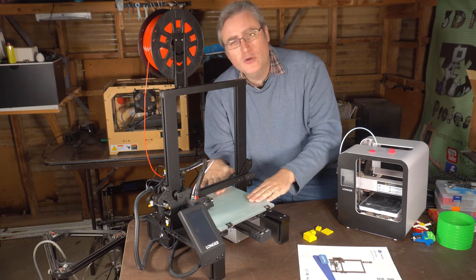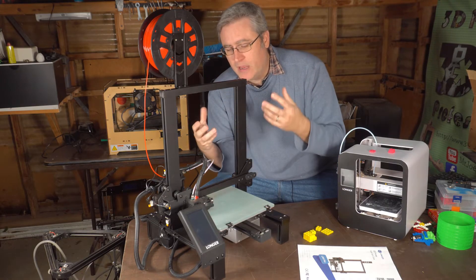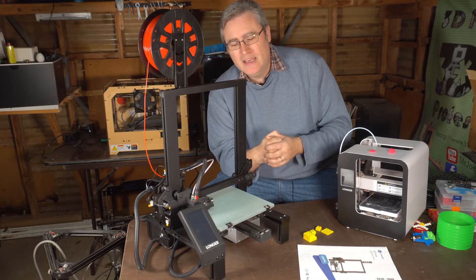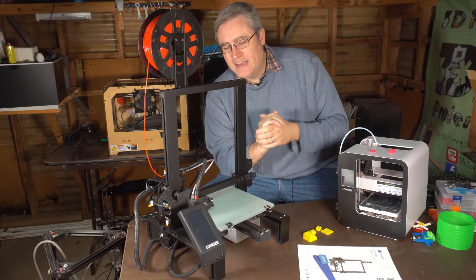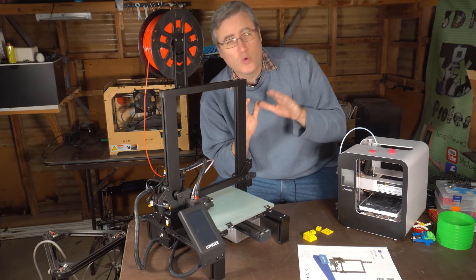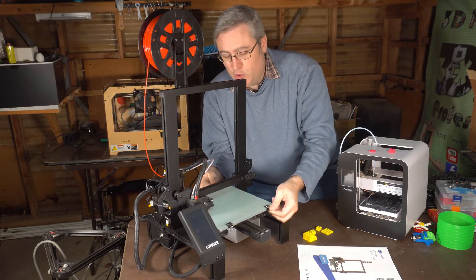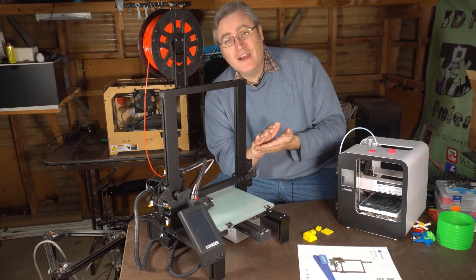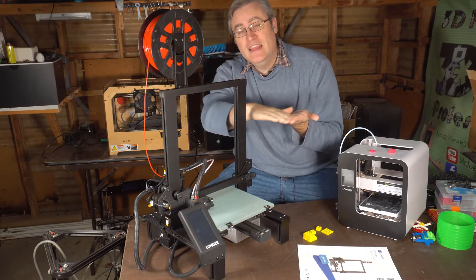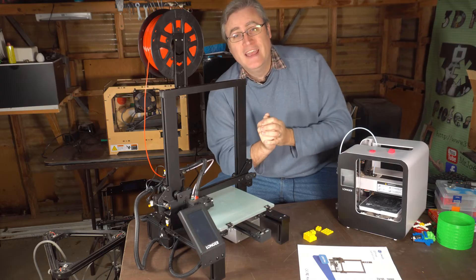I did have a problem with the build plate when I first started printing. I had built the whole build plate assembly myself, thought I'd done it very carefully. Then I put on the build plate, and even after carefully leveling it, it still was showing signs of not being level — almost irregular throughout the whole thing. I decided maybe the problem was that the build tack-like surface they'd put on top was bubbled or warped. Fortunately it's a removable plate of glass, so all I had to do was remove that plate, flip it over, coat it with hairspray. That immediately leveled out the surface because hairspray applied thick creates a liquid surface, and that liquid surface creates a flat surface. Remember: if you use hairspray, only use it in a well-ventilated room. Safety first.